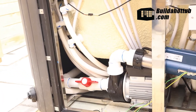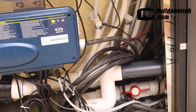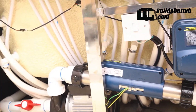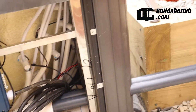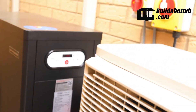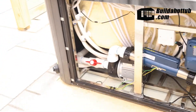And here we have it — the air source heat pump is installed. We've moved that heater over, as you can see, and we've got some new connections down here. We've also installed the Wi-Fi module for Gecko, and you can see that switch there that turns the electric heater on and off. So Paul can decide whether he runs with the air source heat pump with the additional two kilowatt heater, or whether he just runs air source alone, which is pretty cool. Pipes come out the side, and we've got the run down here that are nicely insulated. Over here we have the air source heat pump — it's only on 15 degrees at the moment because we've literally just switched it on, but all is working very nicely. When the circulation pump stops, the air source heat pump stops, and then once the heat kicks back in, it's good to go again.